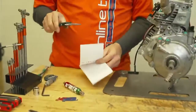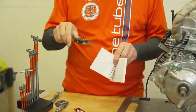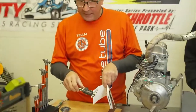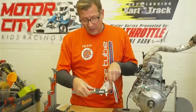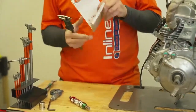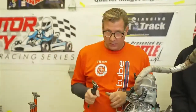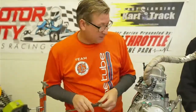When we're talking thousandths of an inch, let me give you an idea of what that means. This piece of paper is three and a half thousandths of an inch. A human hair off your head is about two thousandths of an inch. So when they say it's 'a hair big,' that is a very small measurement.